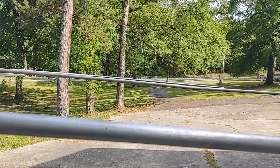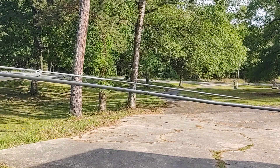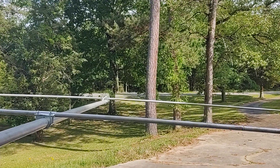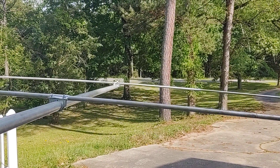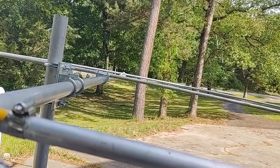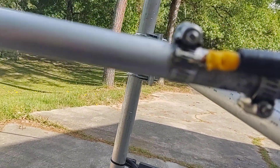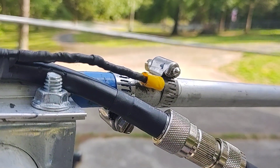The driver element is about 205 inches. The first director is 194 and a half inches, and the number two director — the shortest one at the front — is 183 inches. You have to mount these elements right on the center of the boom, so make sure one side isn't longer than the other. The tubing is cut so the positive side is separate from the ground side.